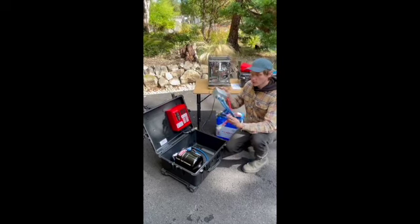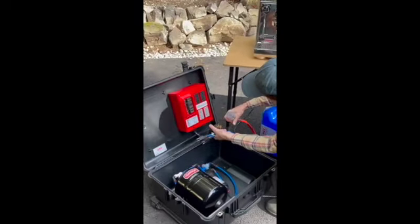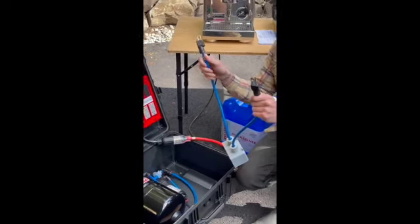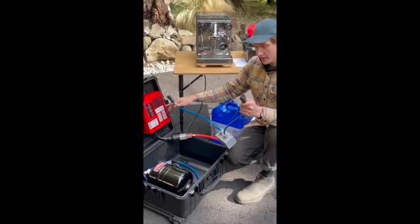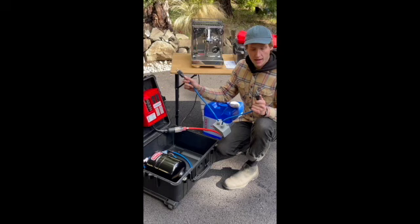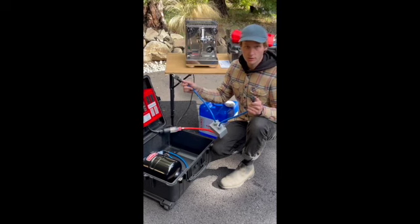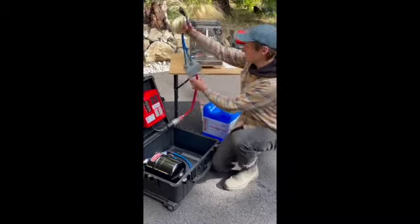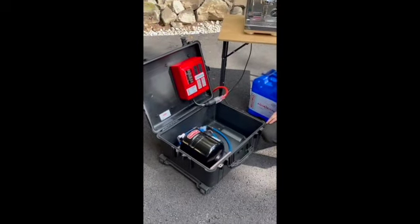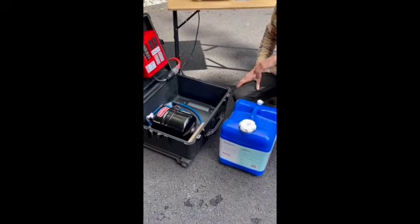Your cable here — some customers will plug that into a generator. Also supplied is the 110 splitter cable, which allows you to plug your system into the wall. The caveat is that the two cords run to two different strips of your GFCI-protected panel; they need to go on two different outlets on two different breakers at the venue. Additionally, the outlets cannot already be GFCI-protected, as the system won't work and would cause failures. We're going to set this aside as if we're running extension cords to two different parts of the venue on two different breakers.